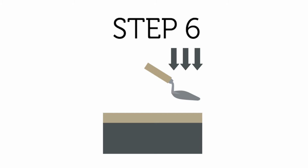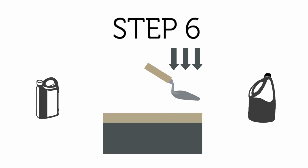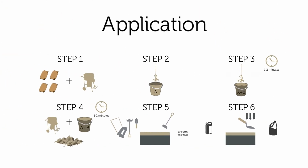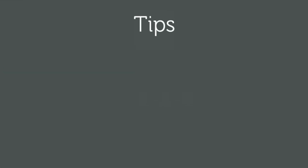We recommend that the trowels and tools are cleaned throughout the application process with a suitable release agent, such as xylene or white spirit. This will remove any excess material and allows the top-facing stones to be knitted together, giving an even, smooth surface. In addition, here are a few more points to consider.